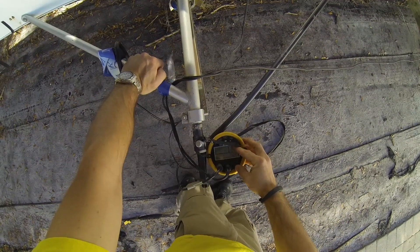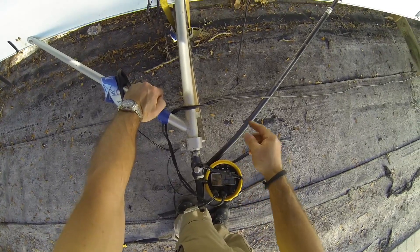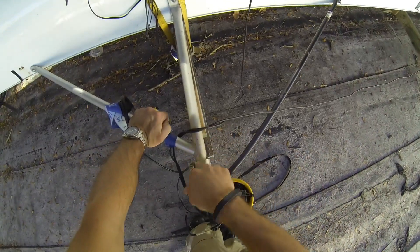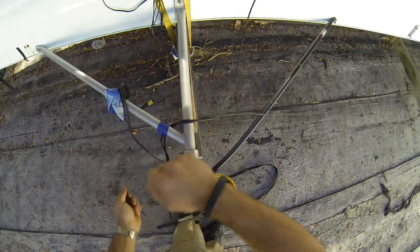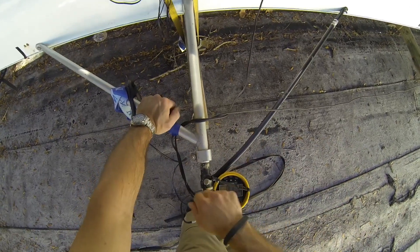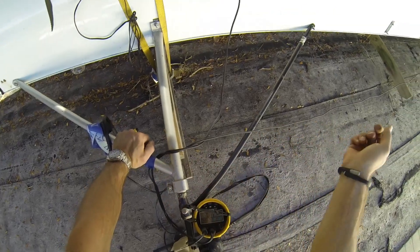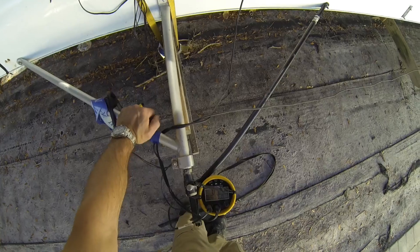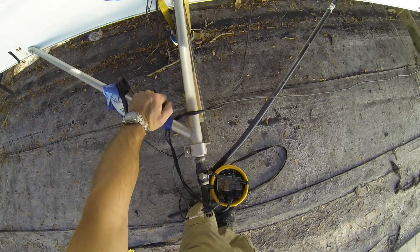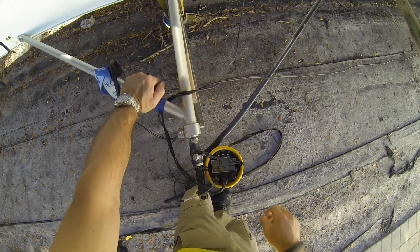That's basically it for your Coxbox wiring system. One thing to consider when replacing the whole wiring harness down the length of the boat is to tape the new wiring harness to the old one. As you pull the old one out through the hull, it'll pull the new one into place — it makes it really easy. Otherwise you may have to feed by hand. The trickiest part is really just getting the wiring harness fed through the channels or through those little holes along the boat underneath the seat decks, so it's all nice and neat. Hopefully you found this video helpful — any questions, shoot us a note on the website. Thanks for watching, good luck.